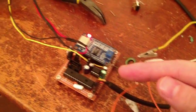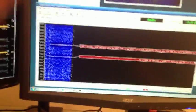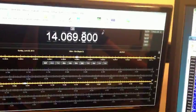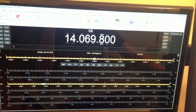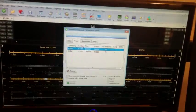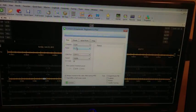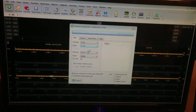The output of the radio goes into this little $2 sound card, and it goes from this USB hub into the computer down there. We can do all the obvious stuff — decoding digital signals like that — but we can also use this commercially available free software, Ham Radio Deluxe, to connect to what looks like an ICOM781. I designed the serial interface to work over this virtual COM port.